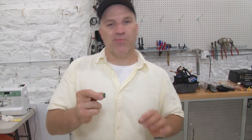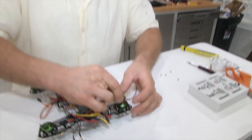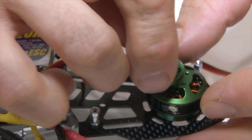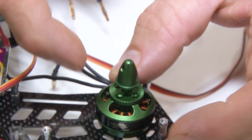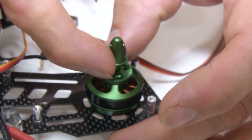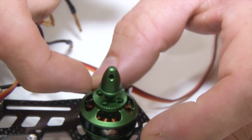If you buy these motors separately, these hub adapters come with the motors. I don't think I've had many times where these weren't mixed up, and this is one of those cases. So if you look at this very closely — this is a clockwise motor, so it's going to be spinning in this direction — this hub adapter is actually reversed. You might just take it out and say, 'Well, it's clockwise, somebody obviously packaged it right.'